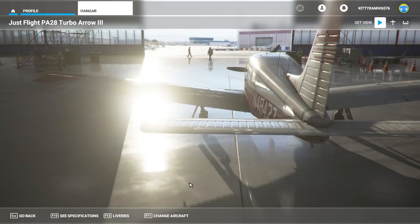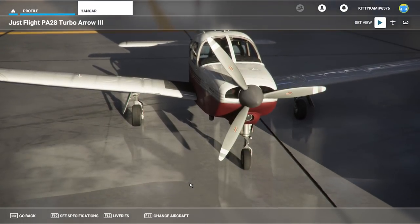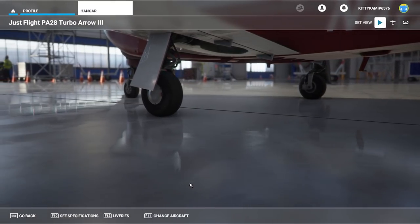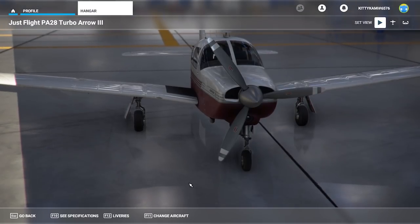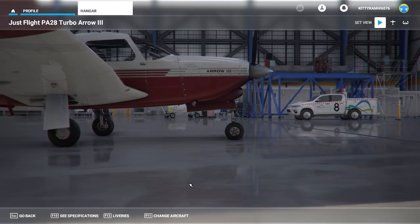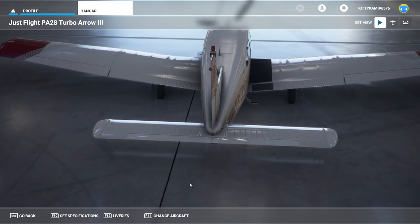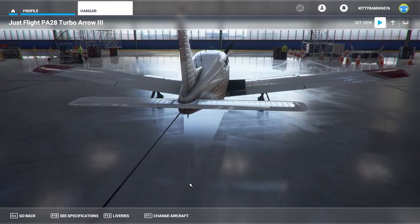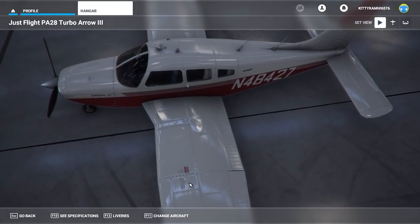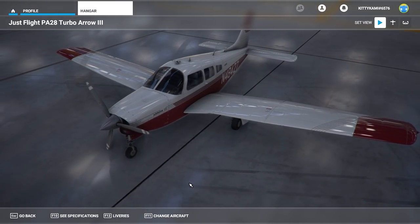Now, on a regular turbocharged aircraft, or a slightly more high-tech, shall we say, turbocharged aircraft, for example, the Seneca, you have what's called a wastegate. What the wastegate does is it starts off in an open position at sea level when you've got plenty of nice dense air knocking about. And as the aircraft climbs, the wastegate will progressively close to increase the amount of compressed air that the turbocharger is throwing into the air intake to maintain essentially sea level pressure, regardless of how high you climb, up to a point. Obviously, you'll get to a point where the wastegate is fully closed, the turbocharger cannot deliver any more power or any more compression into the engine, and you'll run out of puff, basically, for want of a better word. And that's what's called the critical altitude.